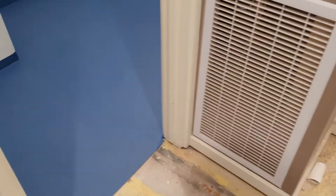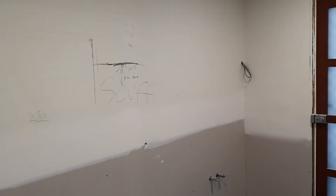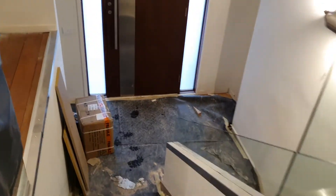Out here, also the laundry - as you saw in the previous video, we framed this wall out and brought it out about 90mm so it was equal with the other side and married in really well. It's all been plastered, ready for tiling and ready for cabinetry. The entire floor is waterproofed properly - all in every corner, right the way around. Where there's no tiles, it's all plastered and looking really good, ready for paint or tiles. In that room, the electrical is done in the wet rooms, and the rough-in plumbing is done.